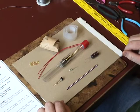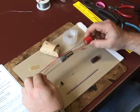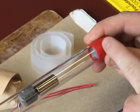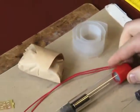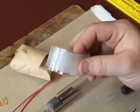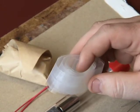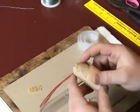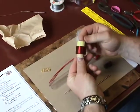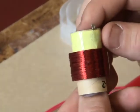This layout should resemble the layout on page 19. We are on step 1. The parts supplied in the kit are a clear plastic tube assembly which has a sponge rubber bumper, a magnet, a red plastic cap, and another sponge rubber bumper underneath the red plastic cap. The second item is clear self-fusing tape — this is not scotch tape and is very sticky when it touches itself, so set it aside and do not touch it until we are on that step. The next part is a coil, which will either be wrapped in brown paper or on a black plastic bobbin with black electrical tape. Either coil in the kit will work for this project.